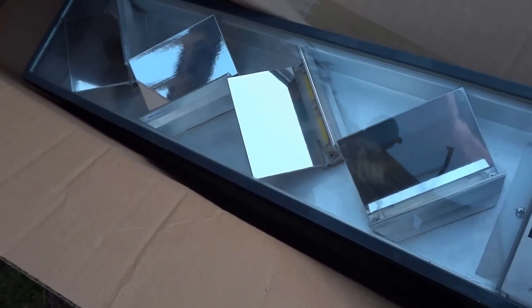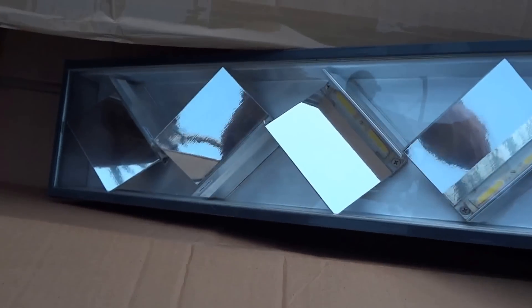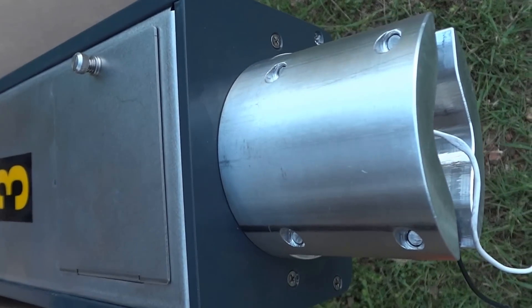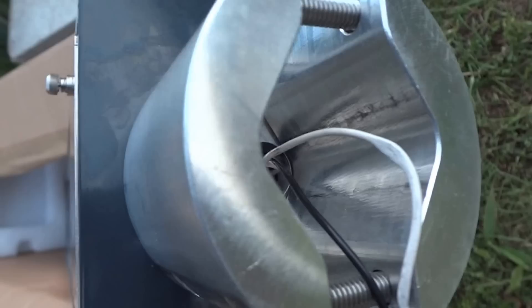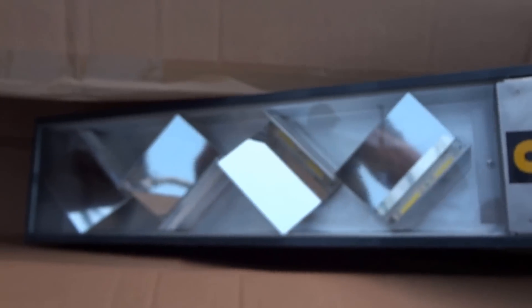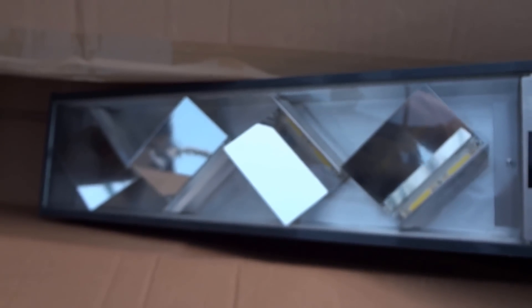Alright, basically I'm going to do this whole installation again. However, I'm going to use the SL Wide Angle 48 Watt fixture. We've got still the round arm out — it's a pretty thick piece of aluminum. This will typically replace a 400 Watt metal halide, 250s, 150s.